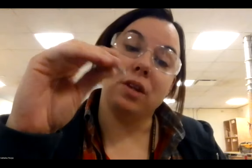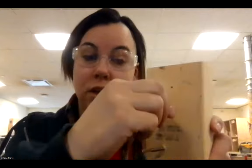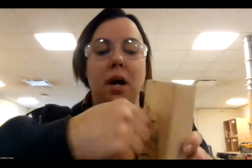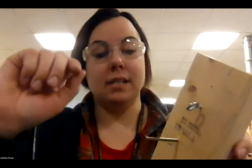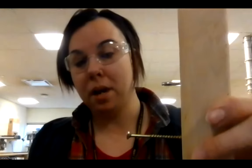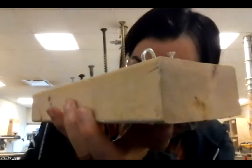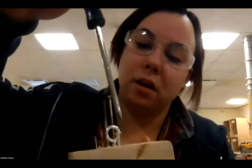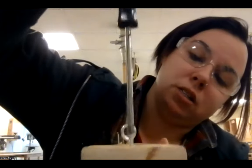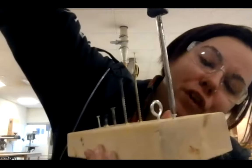This is called an eye screw — sometimes you can hang things from these screws. We often use our fingers and a pilot hole I drilled to twist an eye screw into the board. See how easy it goes in — I just twist to the right, and it goes in because I pre-drilled the hole. Now I could hang something from my eye screw. With a pilot hole drilled in, I can also place a tiny screw in there, find the right bit for the job, twist to the right, and put my screw into the board. Because of that pilot hole I am not having to fight with the screw.